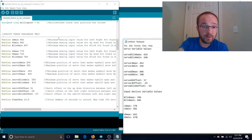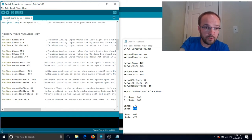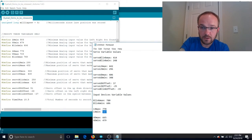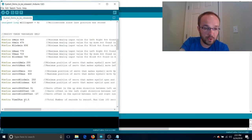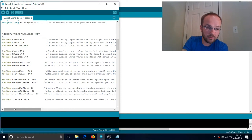Define left-right minimum — the minimum analog input value for the left-right pot. Go look in your saved list: LR min 583, up-down minimum 479, blink min 606. Go through and fill out all these different variables with the values you saved. You can also set the amount of time you want to record eyeball movements — I have it set for about 10 and a half seconds. You can get up to about 160 seconds maximum before running out of memory. For now just leave it alone. Let's upload that code.